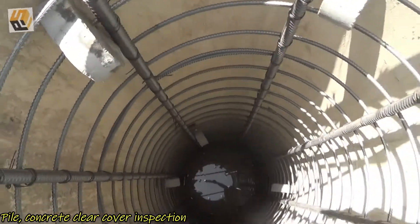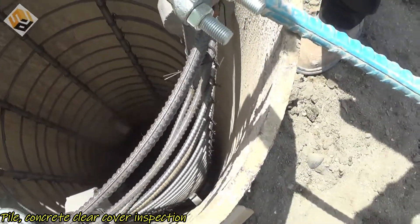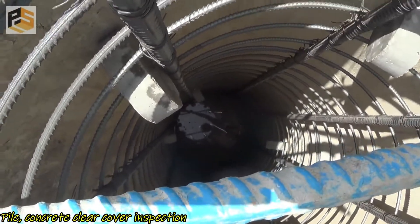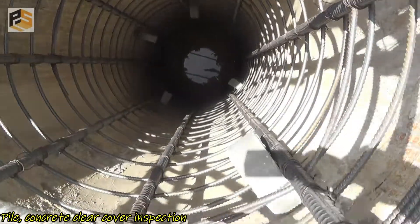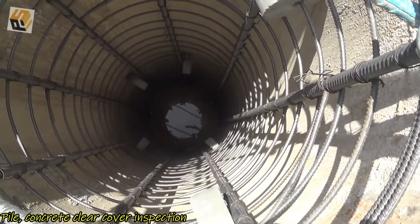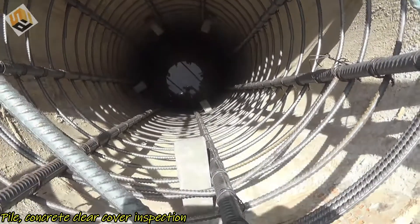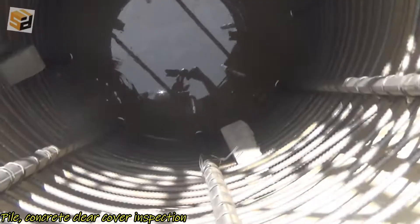You can see clearly that the ground water table is visible. The steel casing holds everything in place. Have a look — it's neat and clean inside. We should check before proceeding with concreting that all these things are okay.